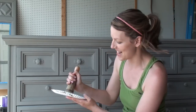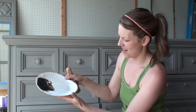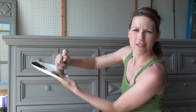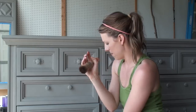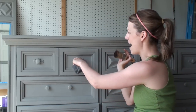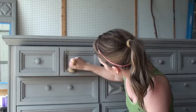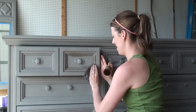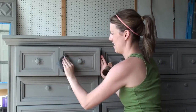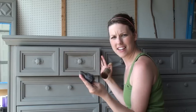This part is very intimidating — I get a little scared every time. You just want to get a little bit of wax on the brush and really rub it in. You can see I have some white in there, so I'm going to get my steel wool ready. I'm just going to go over the spots where I've distressed, focusing on detailing and the edges. Rub that in really well, then take the steel wool over it to get any globs. Now this stuff does shed, so you'll go back and buff and wipe those off after you're done.